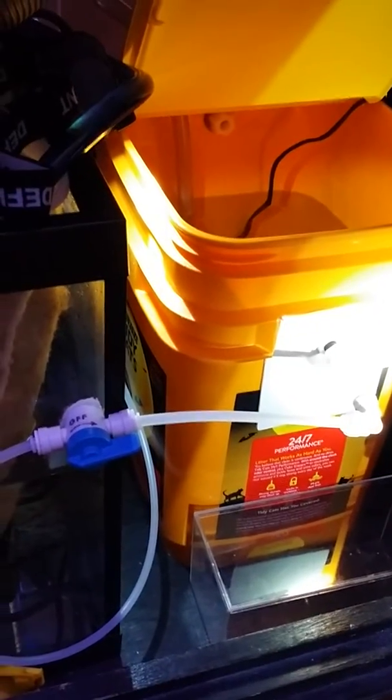Here's a picture of the controller that sits in the sump. It has three sensors on the left-hand side. The bottom two sensors set the max and min differential for your water level, and the top sensor is the alarm sensor. If the water reaches that top point, the system shuts off completely, the pump stops, and no more water can enter — so it won't flood your sump and put water on your floor. It's a pretty simple, pretty nifty system and so far it works great.